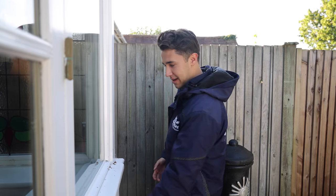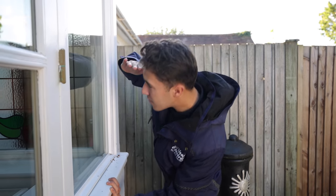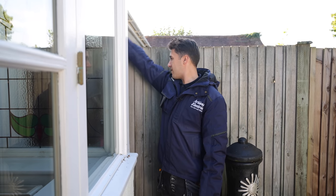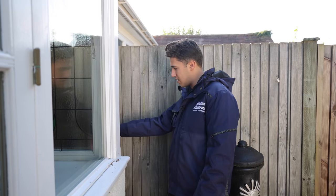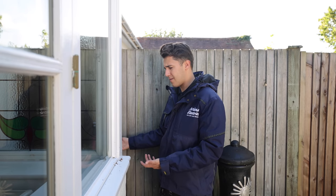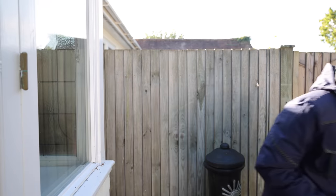It was going to add a socket here, but that would have meant chasing around and then getting behind the radiator. The walls don't really line up very well — the end of that wall is there and the socket is there. I want to try and avoid chasing out on the inside. I'm going to see if I can drill through at an angle and get to that socket. If I make damage, I'm going to chase anyway, so I'm just going to try it.